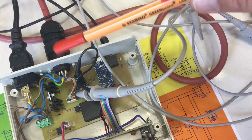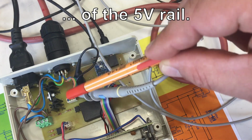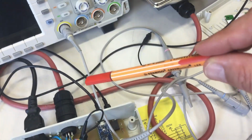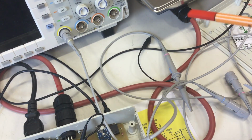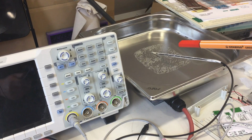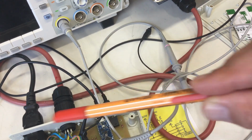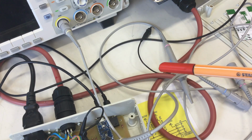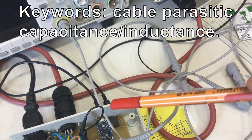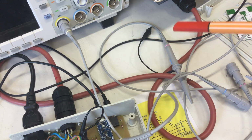And my circuit is not designed to provide parasite power. So, first order of today would be to check the connections from the board through the long, thick cable to the sensors in the water bath. And probably the long, big cable is the reason why my standard 4.7K pull-up resistors are too small and we have these really smooth, slow rising edges in the signal.